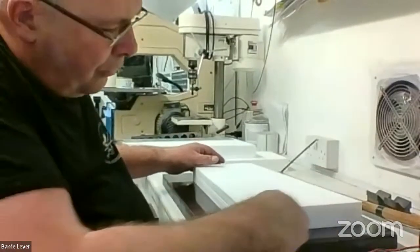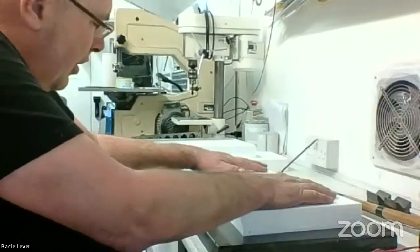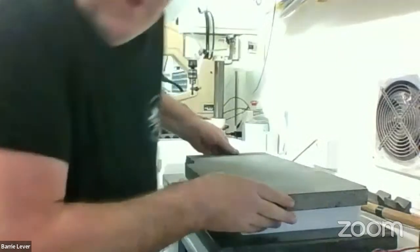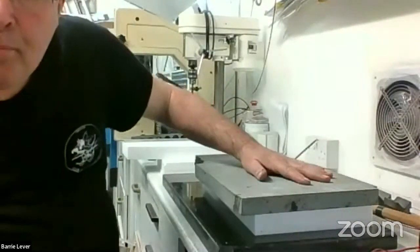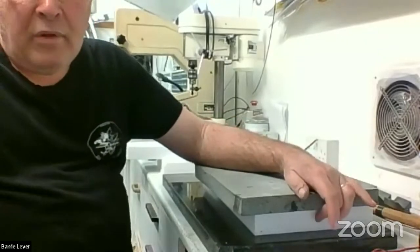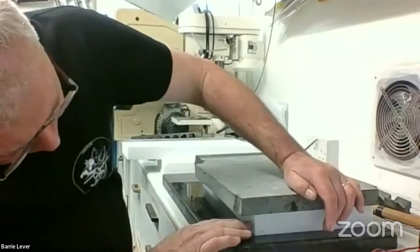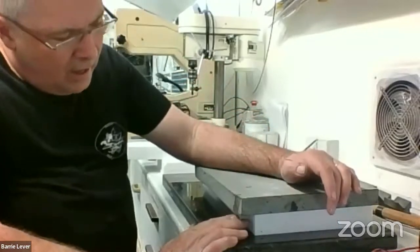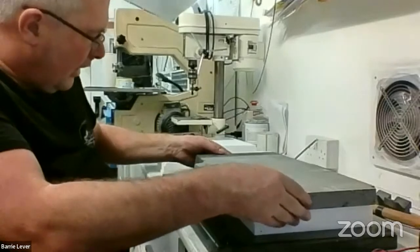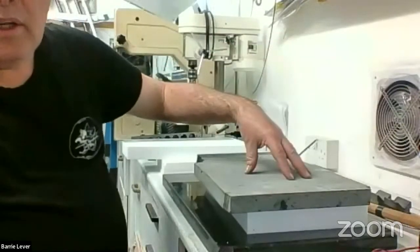Barry shows the pressing process using a second piece of granite as a weight. He presses the skins down nicely. Many people use vacuum bags, but with white foam you cannot pull a strong vacuum — it'll crush it — and you can't control the trailing edge as well. He gets 'super straight wings' by pressing. Ideally you want 70-80 kilos of weight: water containers, old fuel bottles filled with water, old car batteries, or even a Honda generator sitting on top. He wouldn't stack more than two pairs. Once cured overnight, remove the weight.